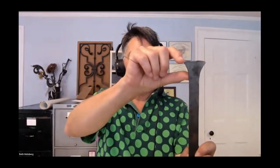When you start scrolling them, you want to hold onto the welded part in a vise so that you're not putting any pressure on it. Okay. Trying to soften the corners. Yes, the snagging issue. That's a great idea, to soften the corners. And that's a look thing. How much do you want it to be this vicious pointy thing versus having a nice little rounded thing? I think that one's a little more rounded. I like the front to be pretty flat. I think if the front isn't flat, it's a little funny looking. If you try and scroll it and there's an arc there, it doesn't read very well. So you want it pretty flat in the front, but this has got just a little bit of rounding there. So I'm with you, Henrietta.